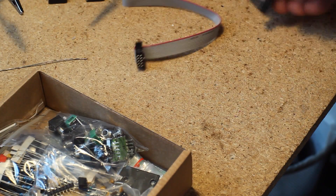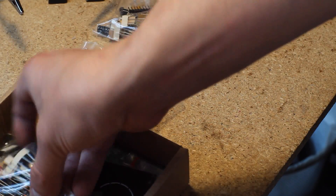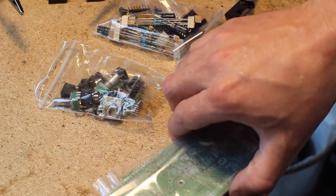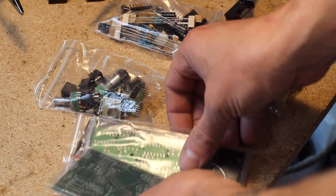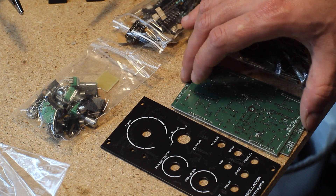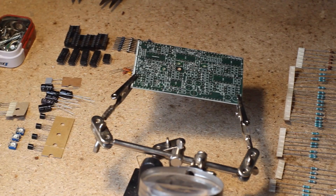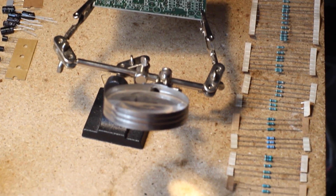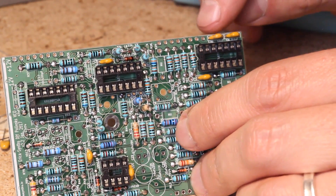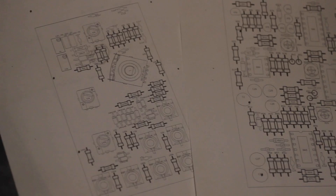This means the PCBs are necessarily sandwiched together and components are very tightly spaced. Many of the resistors are placed standing up TP style and the pads are often very small. A word of warning: considering the tight placement, the small pads and the vertical resistors, correcting mistakes can become quite difficult and you can easily rip out pads and break traces, making troubleshooting very complex and time consuming. So my advice is, do not make mistakes. Try to be very meticulous and thorough. Don't confuse values like 4.7K with 47K or 100 Ohm with 100K. Mind the orientation of all the ICs, as well as the capacitor and diode polarities. Carefully check the transistors and regulators and make sure they are in their correct spots and oriented correctly. Take your time, focus, triple check everything before soldering and you should be fine.